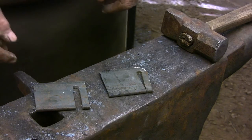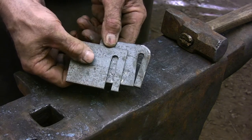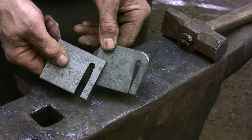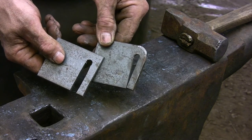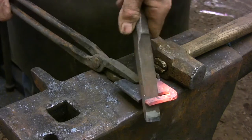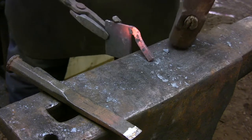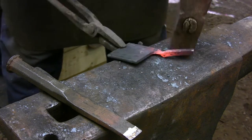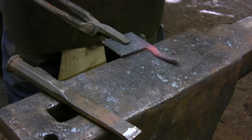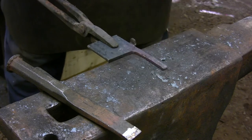To get the material for the hook portion of the plate, I drilled a hole about three-eighths of an inch away from the corner of the top edge of the plate, and then I cut two slots up to that hole. You can see how I've radiused the top edge of the plate — that's going to allow me to unfold that tail portion and forge it into the hook.